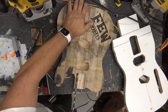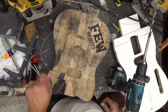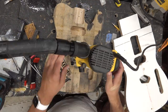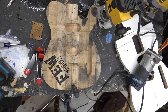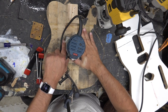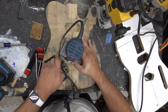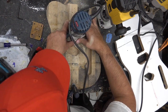Any overlap we can just scrape away once it's all dry. Then come back and finish up routing the rest of the body. You can see I re-routed the pickup cavities and just need to clean up the bottom cavity a little bit, get a little bit more depth. I started doing this on all my guitar bodies where I sort of back-route around the pickup cavities - it lightens up the guitar body ever so slightly and gives me a little bit of flexibility across the body to move all the wires.